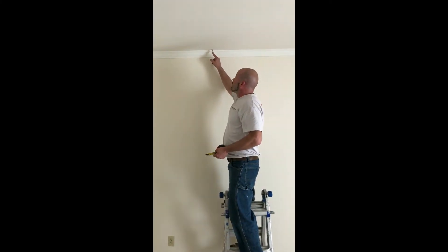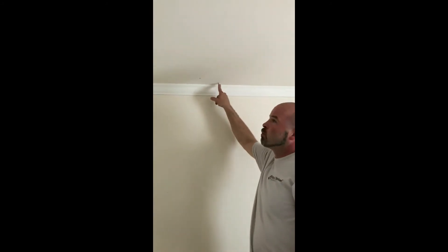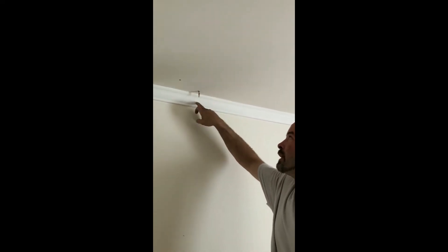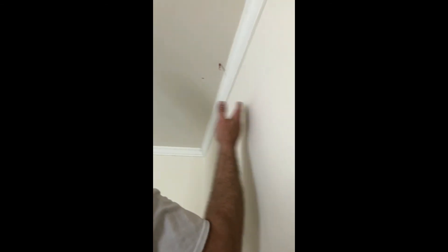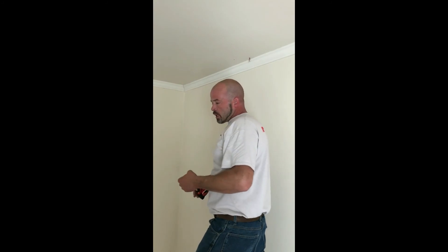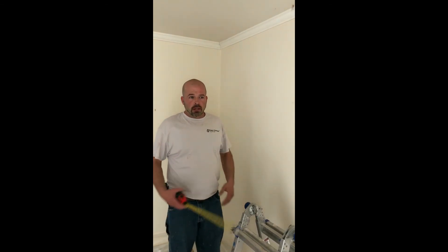Downstairs now — I made a second hole earlier just to determine how tall my joists were and what lumber I'd need. I came five inches off the wall and drilled down, but it did not puncture through the drywall — it was behind the crown molding. So I'm now at seven and a quarter inches off the drywall up there, but down here it comes out at about three inches, giving us about three and three-quarter inches of offset. This wall sticks in further than upstairs, so we're going to have to extend the wall upstairs three and a half inches to make it plumb — so the second floor and first floor are parallel to each other and we have a smooth wall to set our rail on.